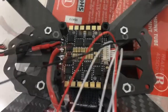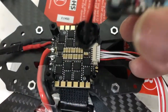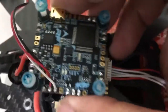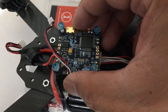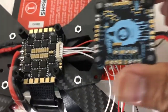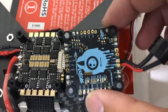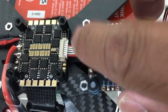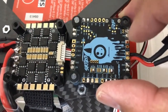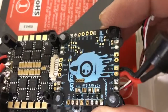Here's how I recommend soldering the ESC wires. This is my Revolt flight controller and it's going to sit this way — that's its regular configuration. What you're going to do is plop it upside down like this and butt it up directly against the ESC. Then you solder the signal wires directly to the correct pad, cut to length exactly.